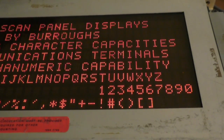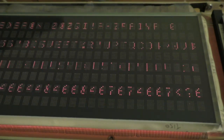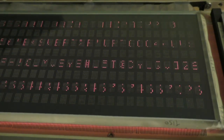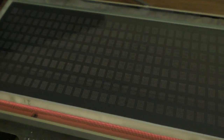If you get the camera really close you can probably hear the buzzing sound — that's actually this display panel making noise due to the capacitive nature of the electrodes. When the scanning glow goes from left to right it causes the electrodes to move very slightly, producing that buzz. For some reason when the display is first turned on it goes into a weird mode, but if you clear the display it fixes it. Now the cursor is there and I can type whatever I want.